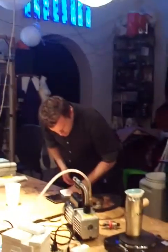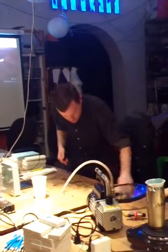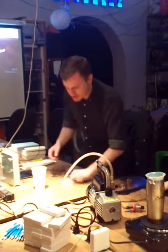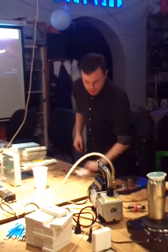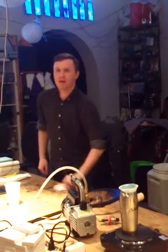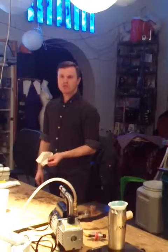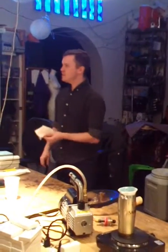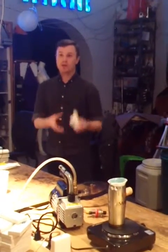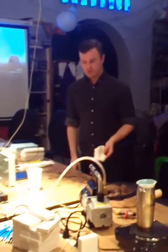One of my favorite aspects of special effects was how much the mold-making people hated the machining people and vice versa. I worked as a machinist, and there was an enmity between the mold-making side and the machining side, because everything the mold makers did would turn into a sticky adhesive that would completely screw up any bearing surface or any press fit. And all of the things the machinists were doing would completely foul a plaster or a plastic. If you got some oil or metal shavings in, if you got aluminum shavings into the silicones, it would cause them to cure in the pot. So, damned if you do, damned if you don't.